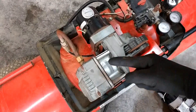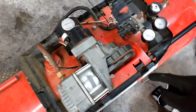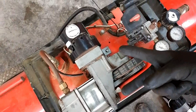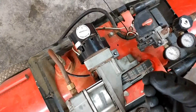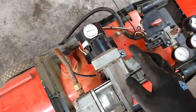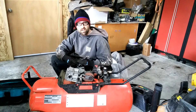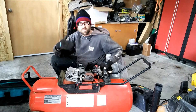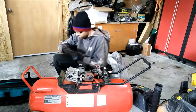Here's a view of what everything is. You have your motor here. This is your air out going into the tank, so you have to take this loose. There's one bolt holding it and a band clamp going across with one bolt there. Taking those two bolts out and taking this fitting off, you'll be left with your two connections — one white, one black. These are spade connectors that just pop off. To take off the air line, it's going to be a three-quarter inch open-end wrench. The two bolts themselves are a three-eighths socket — a socket and ratchet with a six-inch extension.